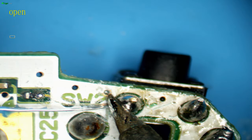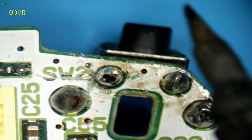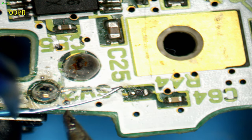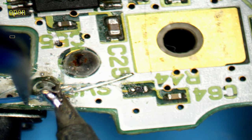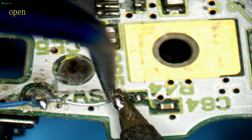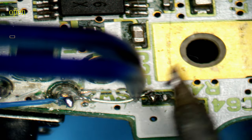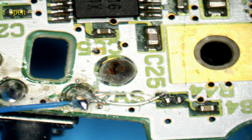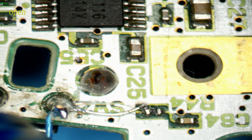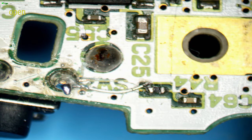Let's place the wire onto the big pad first. And then actually, let's do it the other way around. Circle this around. Let's place this onto the trigger here. And now get the wire just into position and make a connection there. Just move it out of the way of that via. And there we go, we have a connection there. I'll then just wiggle this wire. We've now got that. Let's get the testers again and see if we now have a connection.